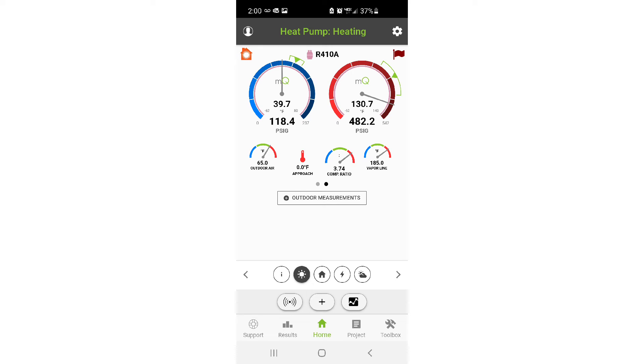Our pressure did come up, meaning that valve is working — it's just not getting enough pressure in the power head to drive it open against the spring. That's a classic TXV bulb that has at least partially lost its charge. We can replace the TXV bulb and get this unit back up and running. MeasureQuick non-invasive mode is great for checking a unit that has already been benchmarked and you're just verifying performance. But on a service call with a problem, you want to use full diagnostics mode with pressure probes so MeasureQuick has all the inputs it needs for a proper diagnosis. Thanks for watching — comment below, and as always, stay safe.